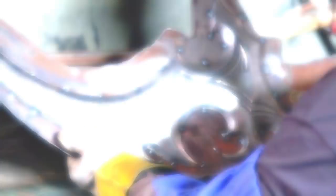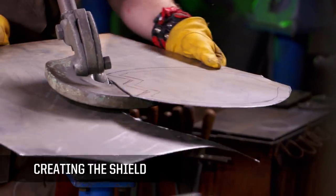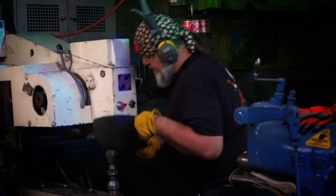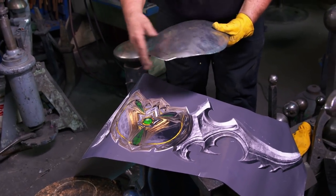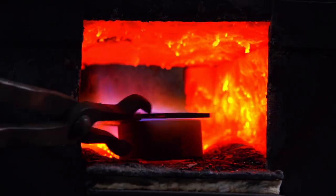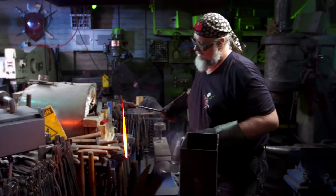This blade's looking pretty awesome. Tony has drawn out our center shield on the 16 gauge, so now we're going to cut that out. Now I dome it out on the Pullmax machine, so it's got a little bit more shape. I've done an oversized shield for the center; I'll trim down the edges. The warglaive blades are much too large to heat treat in-house, but as an example, this will go into the forge. I'll pull it out and quench it in the oil, just to show you how this looks. It's pretty cool.